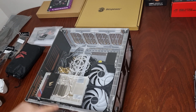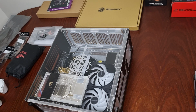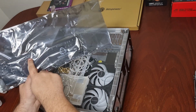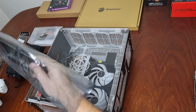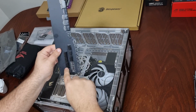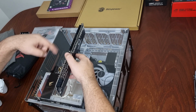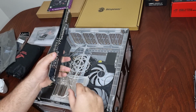When the power supply goes in, which is behind the GPU there, I should have inserted this piece, which is the Singularity Computers' power board. So it's why we had to get this very specific GPU. Now I'll pull it out, make it a lot easier to see. What happens is these here actually go into the GPU like that, and then come out with the ports going that way. That way we don't have to run such extensive cabling to get from the power supply to everything on the motherboard.